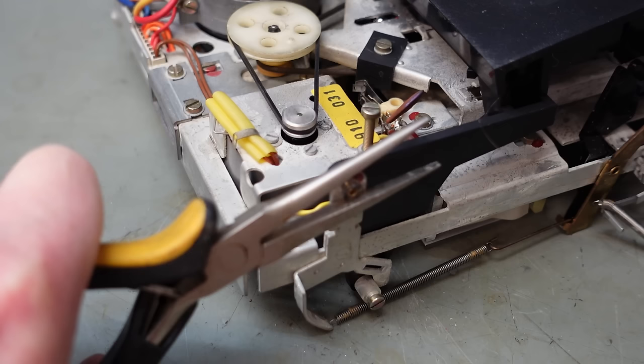There we go. Now I've got to open this up to be 3.5 mil or so. I don't know if that's an insert or something. Let's just push a drill in. This is a 2 mil drill. Oh! Yes, it is an insert. Okay. That looks close to the size of the brass bush, to be honest. Yes, 3.46 mil diameter. It's very close.